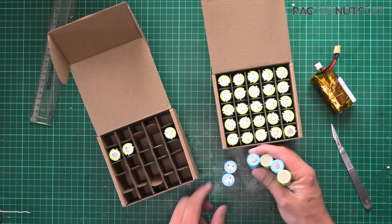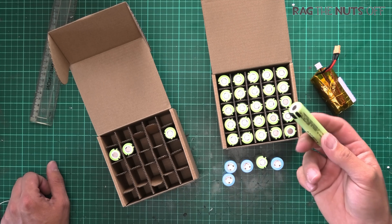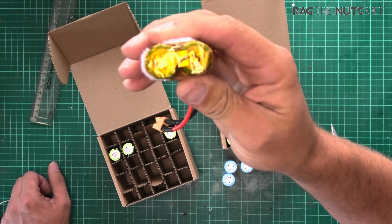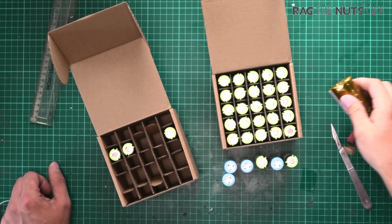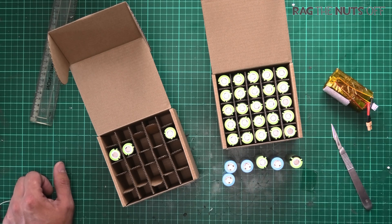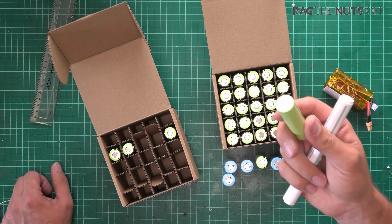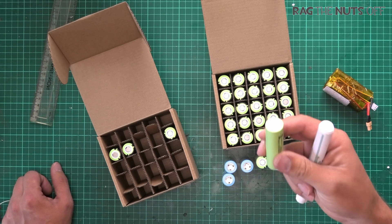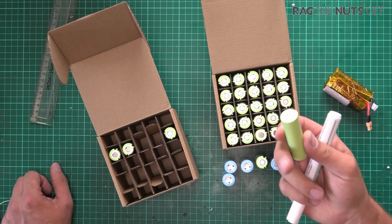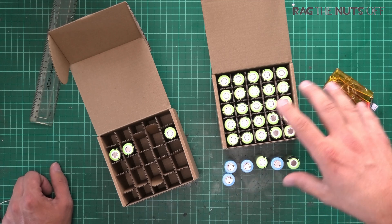That's a rough explanation but I'm sure you know what I mean. Now there are some practical issues - Andy now has a spot welder so he's going to use that. I do join these together with nickel wire, and I do solder on them. I literally just get some 240-grit sandpaper, sand the terminal, put some flux on the bottom from a flux pen - $3.99 from eBay - give it a big blob, get some solder on the bottom, literally less than half a second to get the solder to flow. People worried about heat soak from the solder - it's not very long, especially if you give it a quick blow to dissipate the heat. That means I can make these battery packs any shape I like.